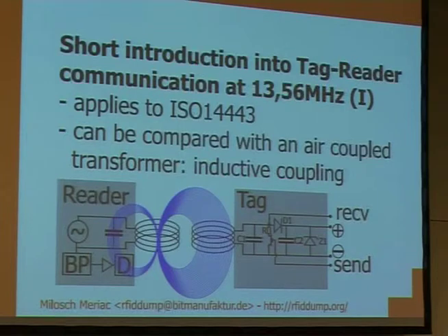You also see the part with D1, C2, and Z1, which handles the power supply part of the signal. It's a simplified schematic. Normally you have a bridge rectifier to get more power; in this case you only get the upper part of the wave, which is rectified by D1, smoothed by C2, and Z1 makes sure that the chip doesn't die if we get too near to the reader, because you can get several hundred volts out of this schematic. The sending part of the reader is simply amplitude modulation of the carrier frequency — you decrease the amplitude of the sender signal either by a given percentage, as specified by different standards, or you completely pull it to zero.